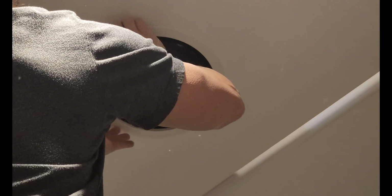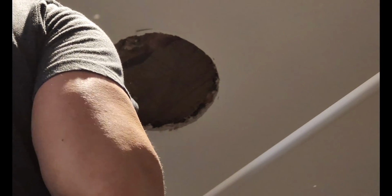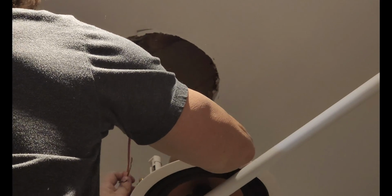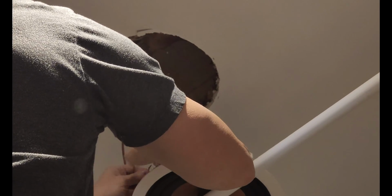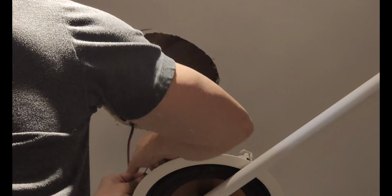And find my wiring. Black is on the left. When you do wiring in your attic, by the way, leave tons of extra wire for yourself. Don't make the mistake that I did on some and have just enough, or maybe an inch or two. Spend the money, get good wires, and also leave yourself way more than enough slack to get this done. You'll regret it if you don't.